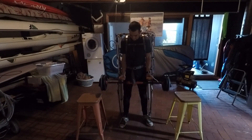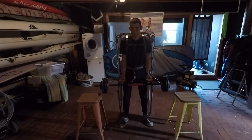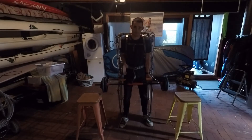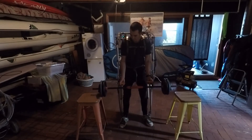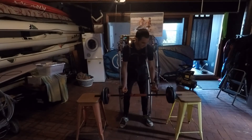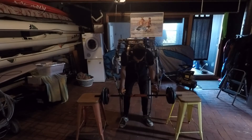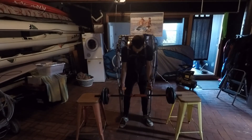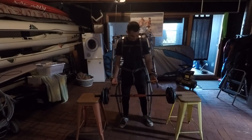The suit can't quite lift 40 kilos at 35 PSI. That's just because it needs more pressure out of the cylinders — they don't have the width to do any more than that. I'll just put this back down. I'll use the shoulders. As you can see, the shoulders push it out a bit. I'm going to lower that down, turn the back off, turn the shoulders off, release the arms, and release the legs. And I can walk around again.